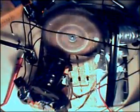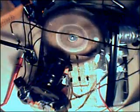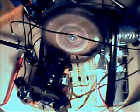The thing with this motor is, anyone else who's built one might be able to answer this. Everybody else's seems to consume around 200 milliamps, and this is a problem that I've been looking into, attempting to understand, as mine consumes on average about 450 milliamps, which is a lot. That's just under half an amp. So with 7 amp hour batteries I'd only get 14 hours runtime. Of course it's pulsed, so it's not using that much.